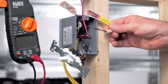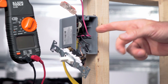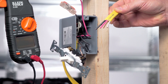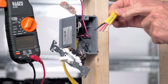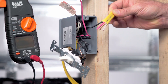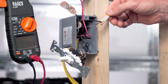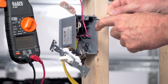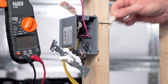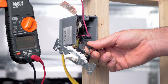Here's a pro tip so you don't get your wires mixed up. Look up inside the box — you're going to see a wire like this. This is a 12-3, could be a 14-3. Within the sheath we have a black, red, and a white wire with a ground — that's going to be your travelers. This one is a 14-2 with ground, and you're only going to have a black and a white wire with no red wire. This style of wire is usually always going to be either your feed or your load on the other end.